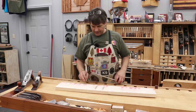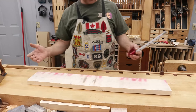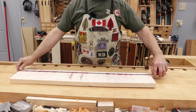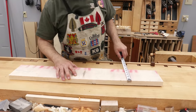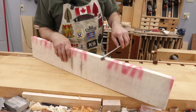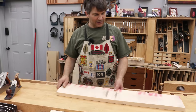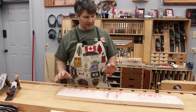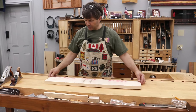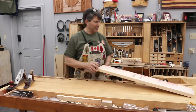Here's what we've got. This is a piece of aspen — it's a hardwood, relatively soft, easy to work. I like it because it's nice and white and makes really good drawer sides. It's just under 36 inches in length, approximately five and three-quarter inches wide, and a little better than one inch thick — considered four-quarter. That's designed to allow us to get a stable three-quarter-inch board. However, it's rocking corner to corner. If we send that through the thickness planer, we'll come up with a smooth but rocky board. Got to fix it.